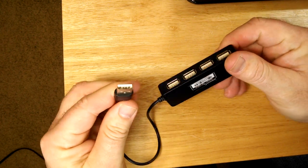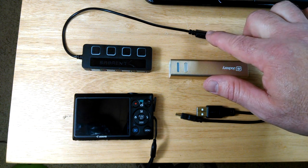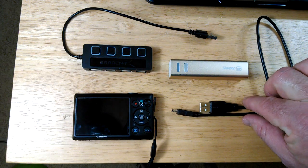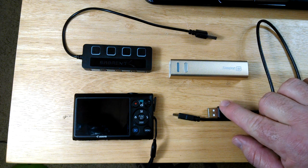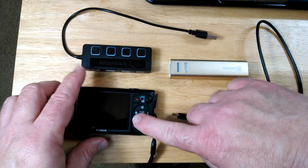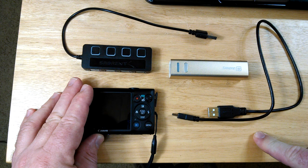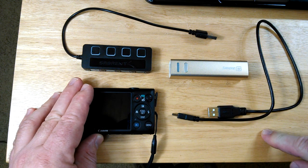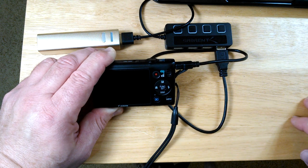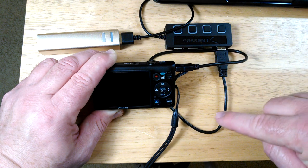Here are all the players I wanted to show you. Here's the power pack, and here's the USB I'll be plugging into the power pack — that'll allow this to be energized. I'm then going to take this USB to mini USB adapter and plug it into one of the ports on the four-port hub, then plug it into my camera. My camera has the CHDK system set up, and I went into the programming and turned on the feature that allows a remote to turn it on and off through its mini USB port. Now with all this together — power pack into the USB four-port hub, one of the ports has a cable going into the camera.